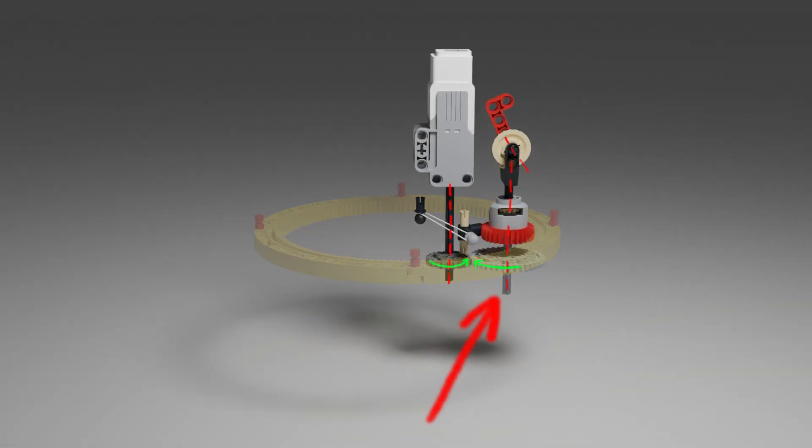In the current version, the motor also rotates one of the differential axes, but the rotation from the differential housing is transmitted not to pressing the selected manipulator, but directly to the turntable — in this case, a large yellow gear rack. The ratchet mechanism is located directly on the differential housing, thereby minimizing the number of components that can play. And the other differential axis presses the selected manipulator.